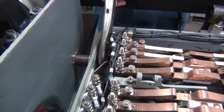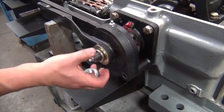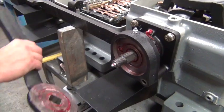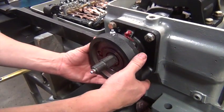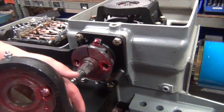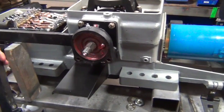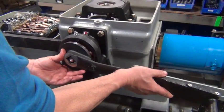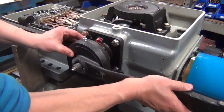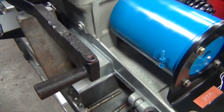You can now remove the pin or vice grip that was holding the cutout switch plunger in place. It will be necessary to change the detent assembly on the selector lever handle — this is the mechanism that locks the hand throw handle when the machine is shifted to the motor position. Do this by removing the selector lever handle and inverting the detent plate and ball. Use care not to lose the ball. Orient the shifter handle so that the handle is toward the motor end of the machine, and be sure that the machine remains shifted into the motor position. Re-secure the shifter handle and secure the detent plate using the long half-inch screws and lock washers that were removed earlier. Remove and reinstall the hand and motor tags on the opposite side of the selector handle so that they correspond to the proper hand and motor positions.